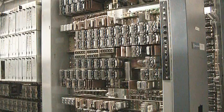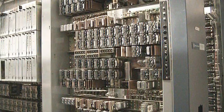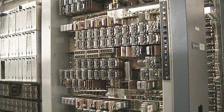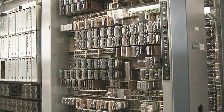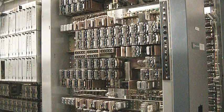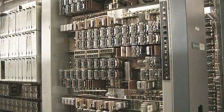The number 3 machine originally was wired with 2 office codes. So it was a 20,000 telephone number switch, but it only had the ability to handle 400 actual telephone numbers. From what I read in the wiring information, Nevada Bell had some stations connected off of this machine that were along highways or mountaintops, and they wanted it to have a different prefix for billing reasons. So they ended up having, I think it was 10 or so numbers out of the second group of 10,000 numbers used. So you had a lot of stuff going to intercept. One thing about the number 3 crossbar, if it cannot complete a call to a line equipment, then it completes it to an intercept trunk, which had a 7A intercept announcer on it.